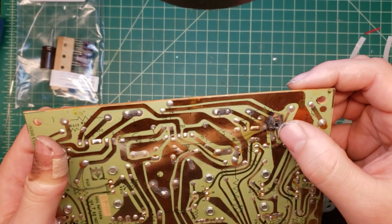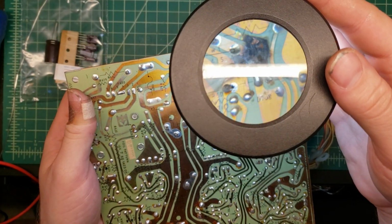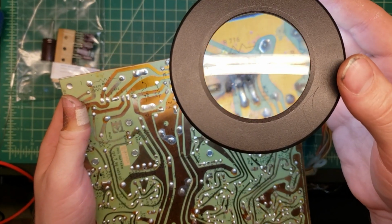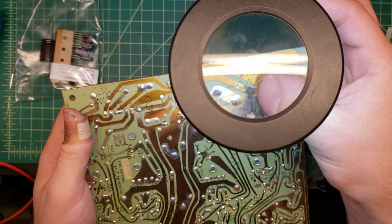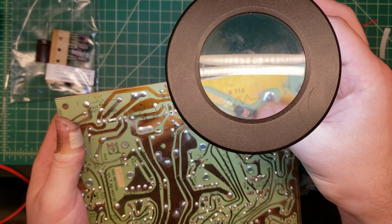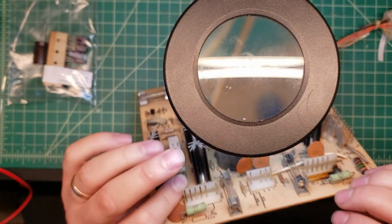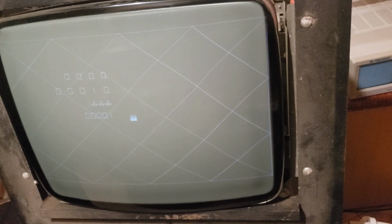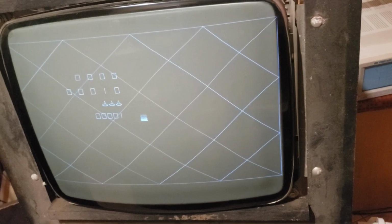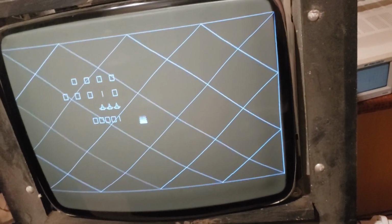The single greatest piece of damage on the machine appeared to be the monitor deflection PCB. Some form of short, likely in a transistor, had resulted in a massive hole burned clean through the board. If I had to guess, this is the failure that consigned this machine to its lonely fate. Replacing all the connectors, filling in the burn spot, and replacing all the capacitors yielded a monitor in beautiful condition with no detectable screen burn, although it did require significant further adjustment to be usable.